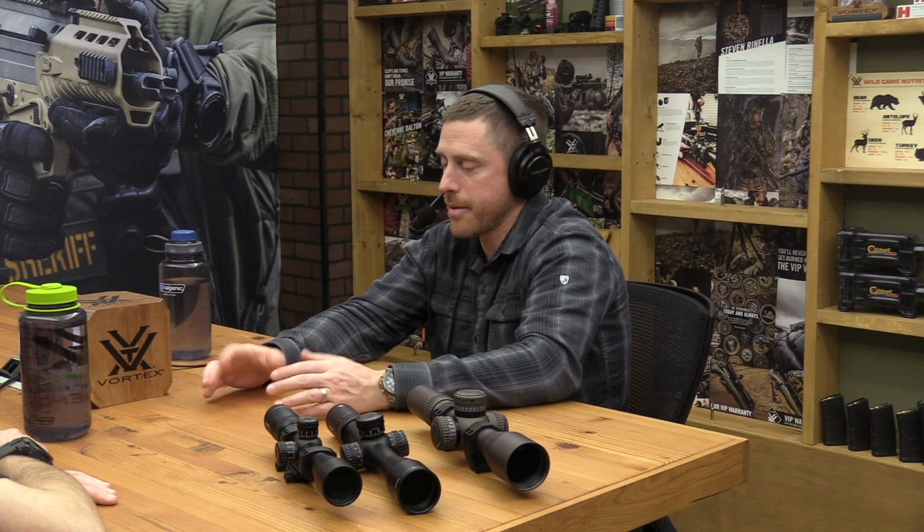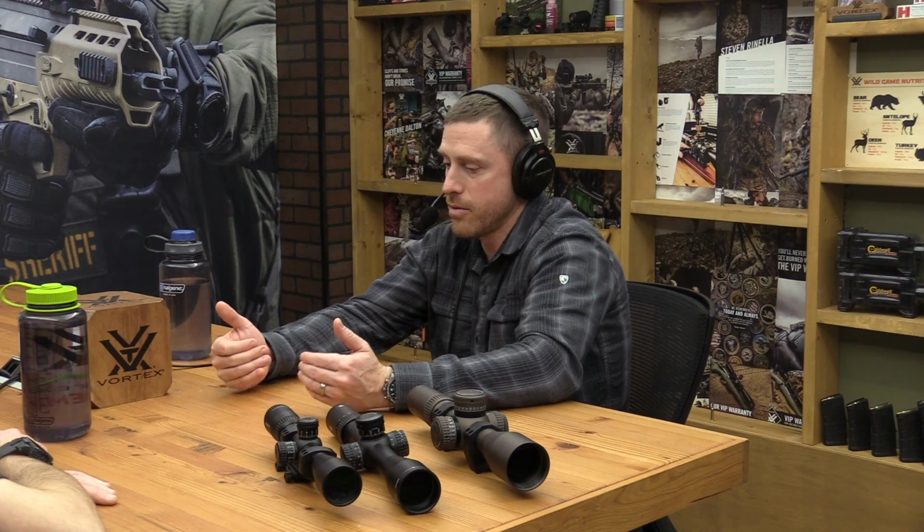And then how are you getting the chrome and the titanium dioxide to actually stay in the trough? Are you putting a coating over that to hold it in? You can, and sometimes that's how it'll be done, but a lot of times you'll cement another piece of glass over the top of it. The chrome will typically stay on a little bit easier because it's adhering to the glass a little bit tighter, since it's vapor deposited on there. But typically you'll sandwich another plate of glass over top. And that's the way to do it.